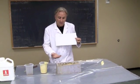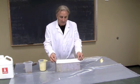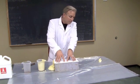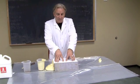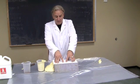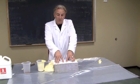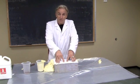We're going to use this plate to back-pressure the foam. As the foam comes up and gets to the top, I lay the back pressure piece on and allow it to come out the sides while holding a little pressure. As you work with a mold you can become more skilled at how much to load it. In this case we could use a little bit less foam, but you don't want to under-load the mold because you'll end up with voids in the face of the piece. We hold this until expansion is over, then let it cool before removing the part.